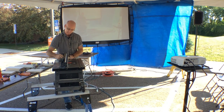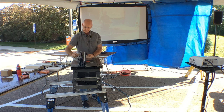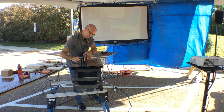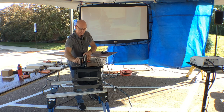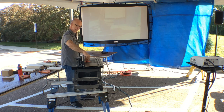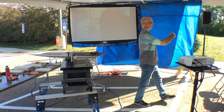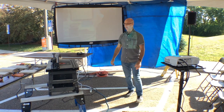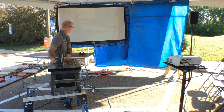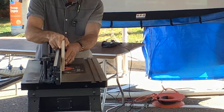Instead, I'm gonna close my fence faces a little bit. The way I'll do this is, I'm gonna turn that router bit so that the cutter is top dead center away from the fence. It's at the highest, furthest point of its arc away from the fence. Then bring the fence over and bring the material down the fence.